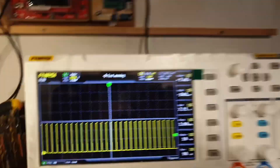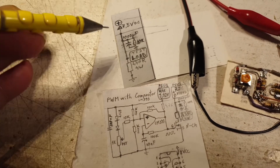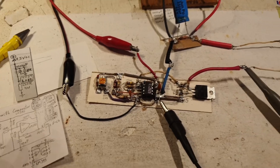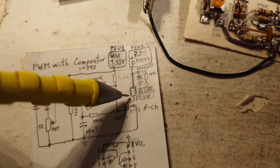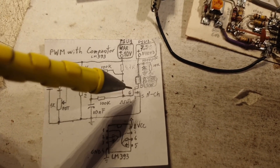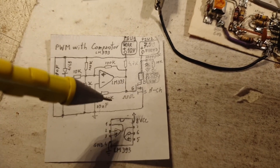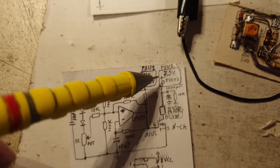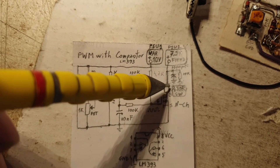Back to 100 microseconds per division — voltage peak-to-peak is 7.70 volts. This is an absolute success. The biggest problem that eluded me all this time was this load resistor. Very interesting lesson involving the power supply, filtering, and load resistor value. I'm very pleased. The circuit is switching normally now. The problem is that the bigger resistive value causes power to dissipate over the resistor instead of the transistor itself, which is my actual target.